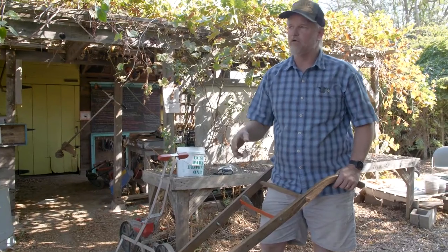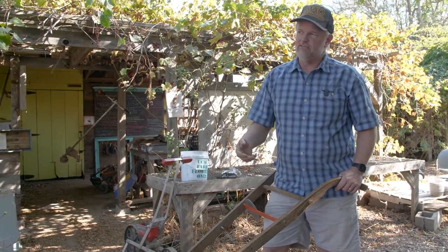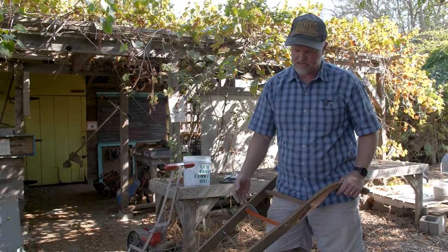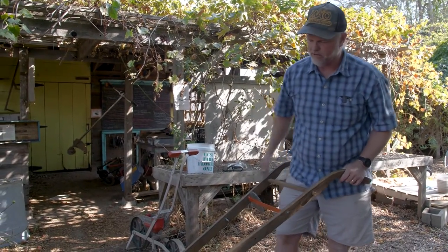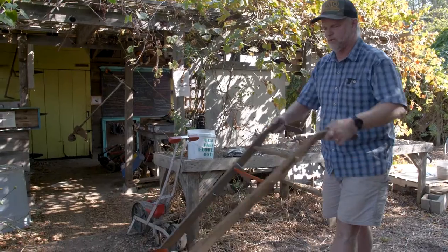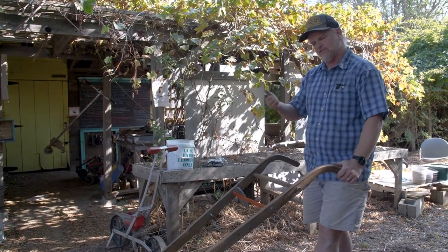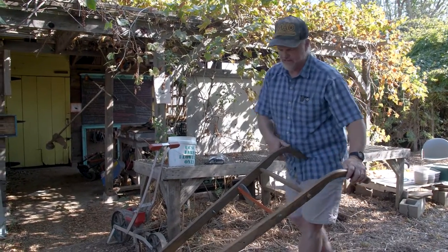And in hard or really bumpy ground, sometimes that's problematic, but if you have raked off the soil surface, it should operate just fine. In worst case scenario, you might back the depth of the shoe up a little bit, because right now that's sort of the pivot point between the front and the back wheel. But if the shoe isn't cutting quite as deep, then you shouldn't have a problem with seed to soil contact.